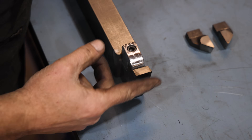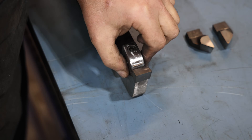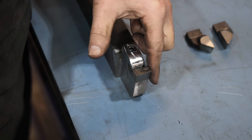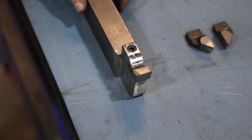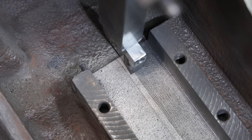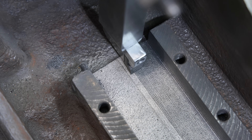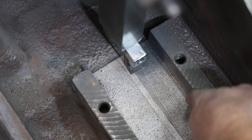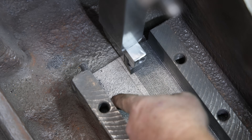I'm changing out my tools again. I've got a flat-bottom planing tool that we're going to put in there — this one should let me go from side to side running straight up and down, cut right across that bottom, and hopefully flatten it out. This is a finishing tool for making a surface flat. I've got my planing cutter down in the bottom, set it as flat as I could, tightened it up. The idea is I'm going to sweep from one side all the way over to the other — I should have enough clearance to go all the way across side to side.